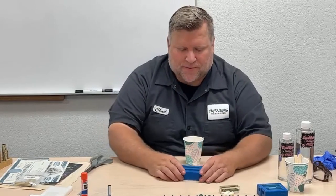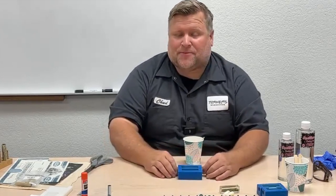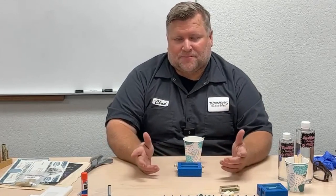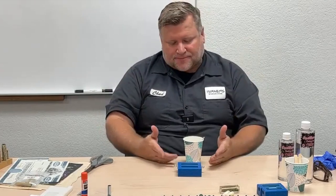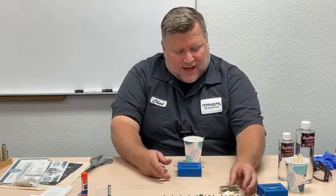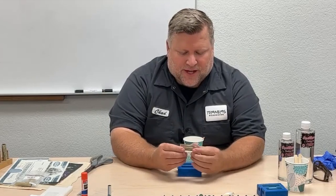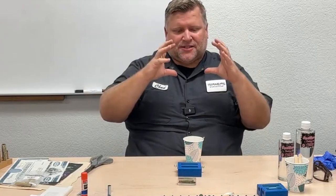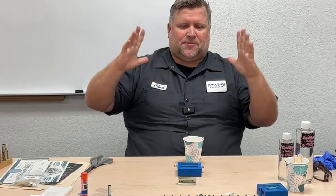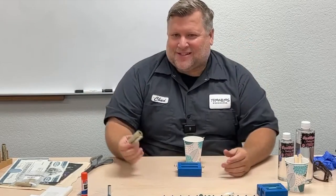The question is, do you recommend warming the mold? Do I recommend warming the mold? No. Many people do, and it's fine. Warming the mold will typically help you with corner wicking and things like that. With this epoxy, I have never noticed a problem with it retracting too much, because what happens is the epoxy shrinks, and warming a mold helps keep your material spread out into the corners. I don't find that that's an issue with this.